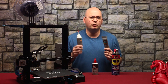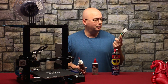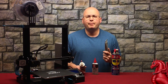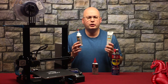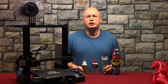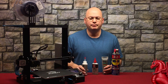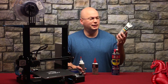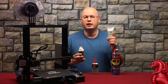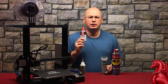A lot of people use oil for their steel guide rods and synthetic grease for their Z screw. I used to do this. Super Lube makes a very good synthetic grease that also has PTFE in it. However, the disadvantage of using oils and greases is they are sticky — they will attract dust and dirt over time, so you'll have to periodically clean that off, as it will inhibit movement and affect print quality. Greases attract more dirt and dust than oil, so I tend to stick with synthetic oils.